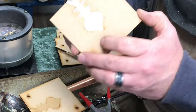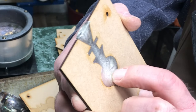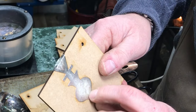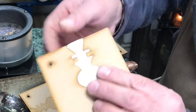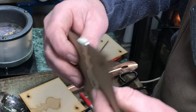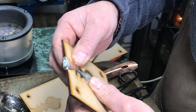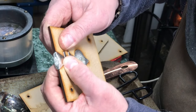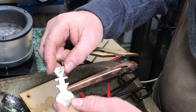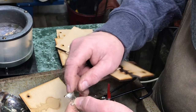That one's okay. This one has a slight pit — either some slag trapped in there or a slight air pocket. We could do that again but I'll just make that the back of this one. When getting them out of the molds just be gentle, tease them out carefully, and they'll come out. The sprues are going to get chopped off — we'll do some work on these anyway — and you can chuck them back in the pot.